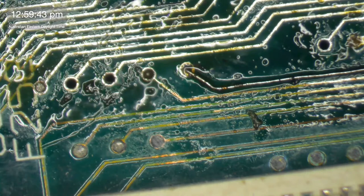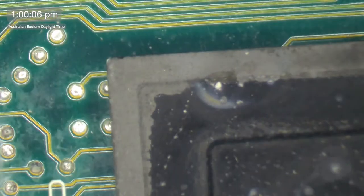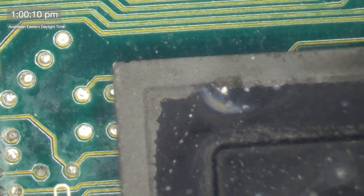So I'm just going to check one of the others. Let's say pin 8 of the video ROM. I think we can safely say if we get to... Which is the video ROM? Video ROM UK6? UK6, okay, so pin, what is it? That's one, isn't it? 1, 2, 3, 4, 5, 6, 7, 8. Pin 8, yep. All right, so that's good. So we've actually been able to establish a connection there.